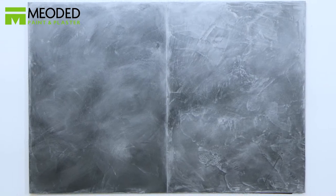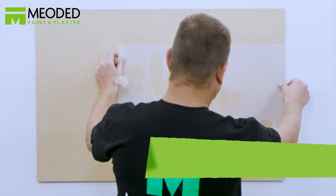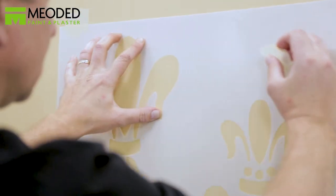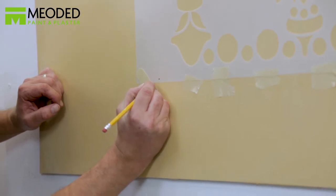The Stucco LaMundo black marble finish brings a cool sophistication to any interior room. For another option, you can choose the Stucco LaMundo stencil effect. Choose your base color preference — we've chosen Antique Yellow. Follow the directions for Stucco LaMundo regular, priming the wall and adding your first two coats. When the second coat is completely dry, use light masking tape to tape the stencil onto the surface — strong tape might rip the plaster. To help ensure that the stencil is even, line up with tiny holes at the bottom and top of the stencil and fill them in using a pencil.